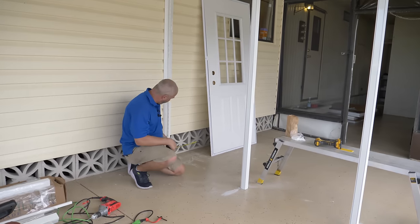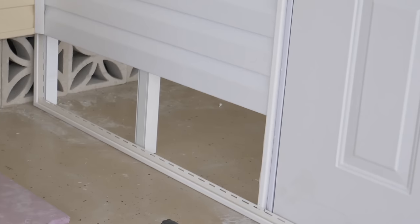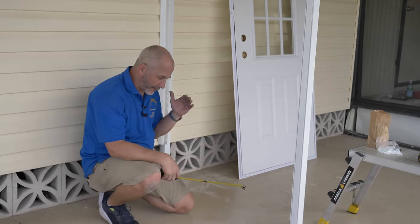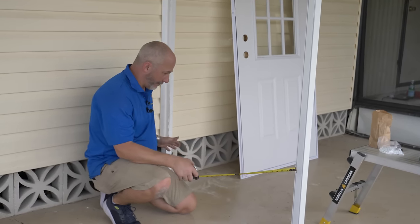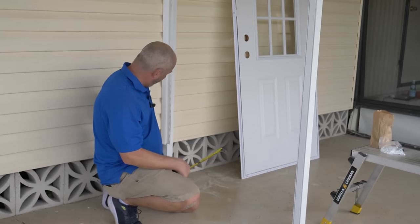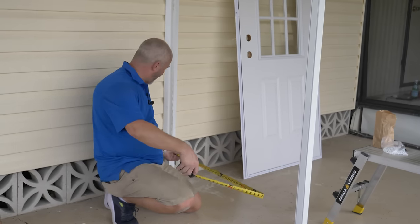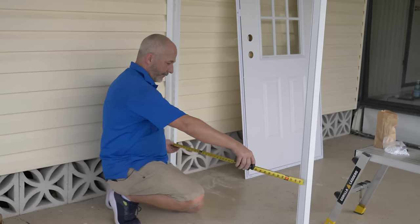Now I'm gonna be building a skirt that goes from here to the floor. It's gonna be basically vertical pieces of soffit, and it's gonna be just a smooth flat soffit inside of J-trim. But we'll add that after the fact. What we wanna do now is think about the end from the beginning here. So that here is gonna be my first course of siding.